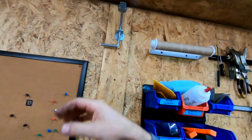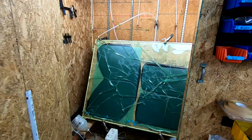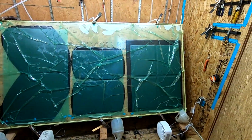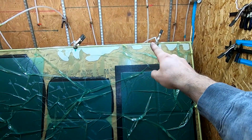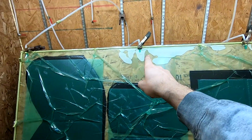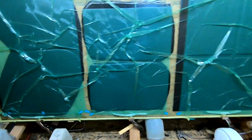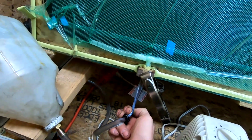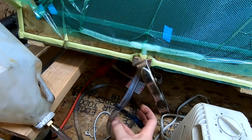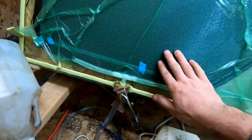All right, so it's been a couple hours. We're going to open up the oven and see what we got. So like I mentioned, the epoxy made it all the way up to the vacuum tubes. Well, not quite to that one. Definitely that one, because it was a much shorter distance. Everything looks good. It might be a little hard to see in the camera, but this hose, this infusion line, got sucked flat, so we know we got good compression of the laminate.